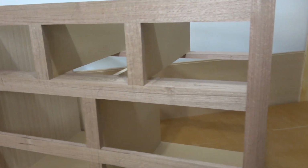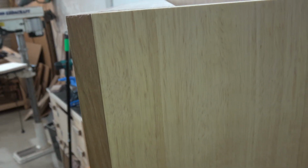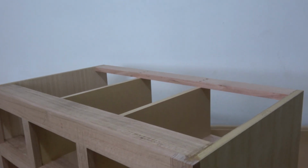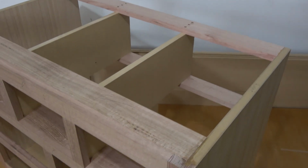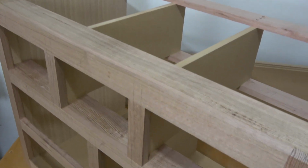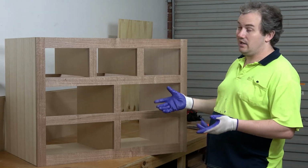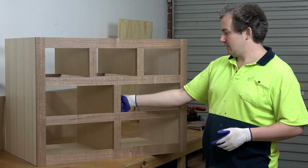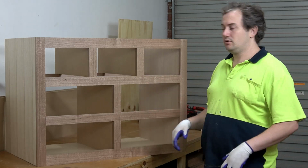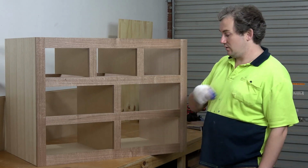So that's it there. Next video, or next week, next video, whenever, I will apply the scotia mold around the top of this carcass, the plinth on the bottom of the carcass. I'll also flatten out the top panel and put the bullnose edge around that, put that on top of that, and then from there all I need to do is apply the drawer slides on these walls inside there, build the drawers, stick them in there, put the overlay drawer fronts on there, and then slap a coat of finish on there.